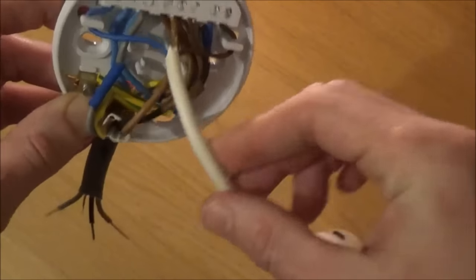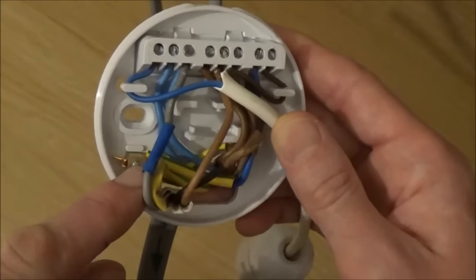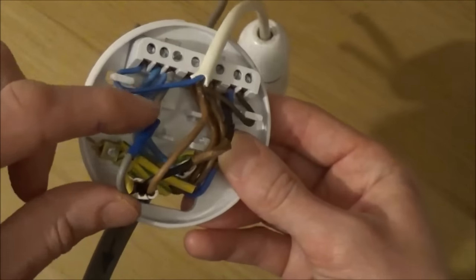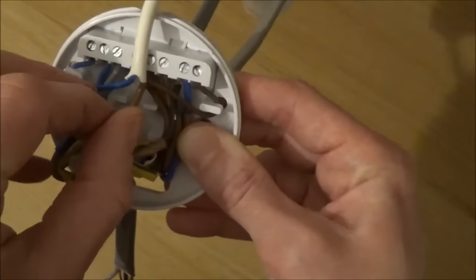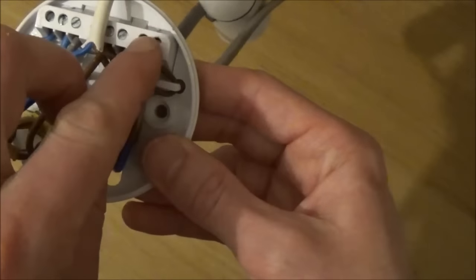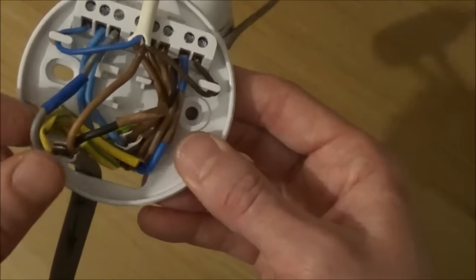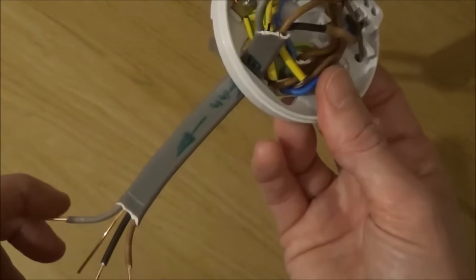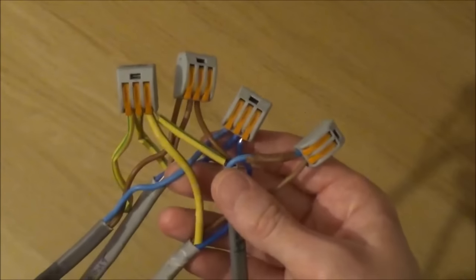This cable is slightly wider than the standard two core. Moving the pendant out of the way, you can see we've got the neutral, the loop, the line, and the earth terminal. Using your three core and earth cable, it's as simple as taking your grey cable from the neutral with blue tape around it to indicate it's a neutral, your brown cable — the permanent live — from the loop, and your black cable as the switch live from the line terminal, covered in brown tape to show it's live. The earth is taken to the earth terminal, and this makes its way from the ceiling rose through the ceiling and down to your isolation switch.